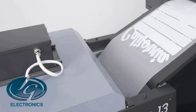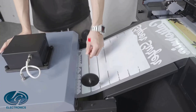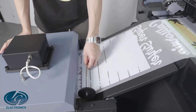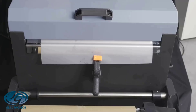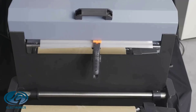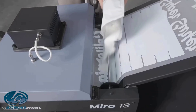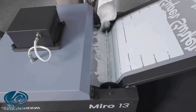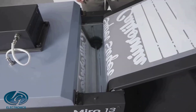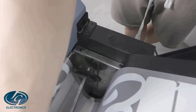The automatic shaker oven is perfect for production volumes. If you are going to do small volumes, you can shake the powder onto the print by hand and use the infrared curing oven — this is an optional extra which is essential to ensure even curing. Some people put the print into an oven or heat press to cure, but results are unpredictable and can result in the shirt being rejected. The beauty of using the automatic shaker and curing unit is that you can set the printer to print and do something else while the print is being made ready for transfer.